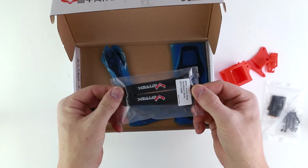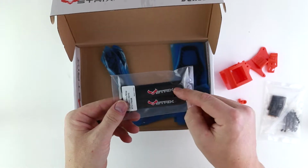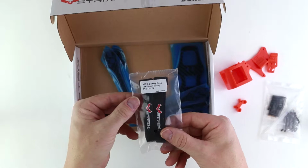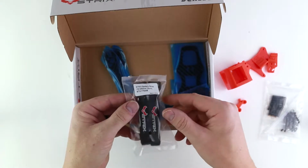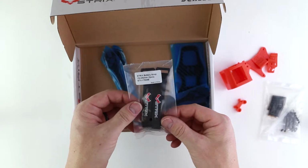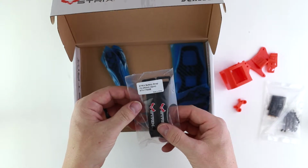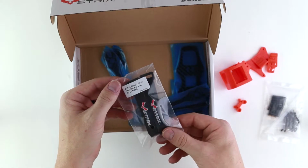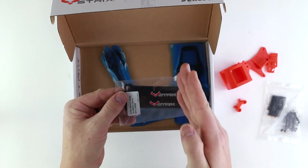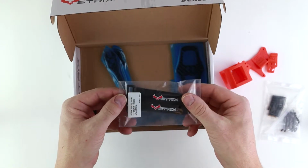You have 2 straps. These are your straps. These are vinyl. They're a little bit thinner than most straps. They are a little bit longer as well, as they are 15 millimeter by 250 millimeter. The reason why is because most people are going to 1550, 1600 milliamp hour batteries on 4S. And if you're using double lock or any kind of pad or anything like that, you really need that extra strap. If you're running 1300s, you may have to trim the edges off of these just a little bit. They're a little bit long.